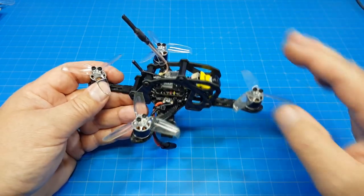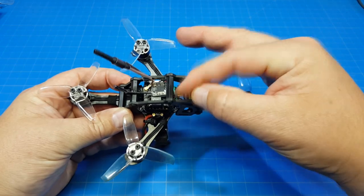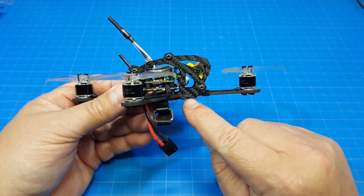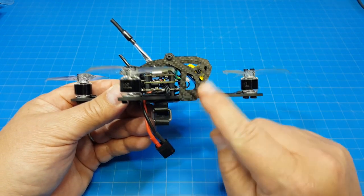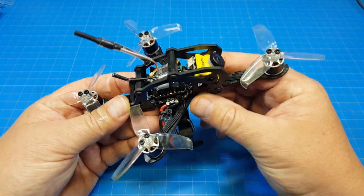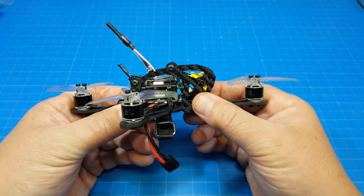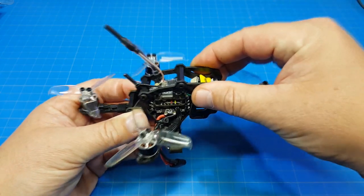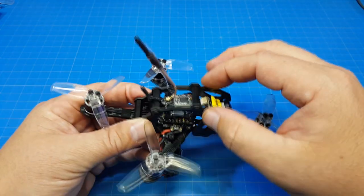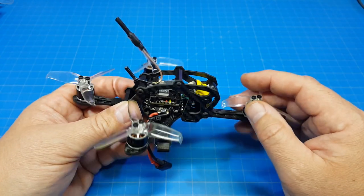But a few things about this: it's got the classic Eclair pod design that he uses here with M3 hardware, and these are nylon, and I find that these hold up very well, and it's probably because of the interlocking mechanism that the pod has with the frame, so that is nice and substantial there, and it fits nice and flush. It doesn't go on real hard, nor does it go on real easy, so I think that connection in there helps to create a secure pod. But I do think if you happen to run anything sideways, you may end up tearing one of these nylon pieces out, but you should have a nylon kit if you're in this hobby very long.